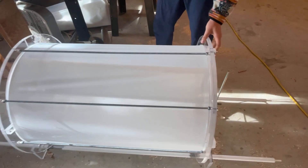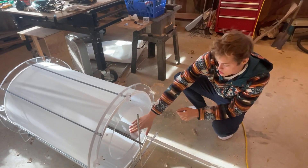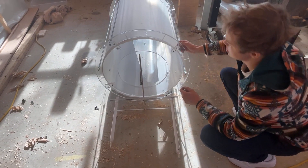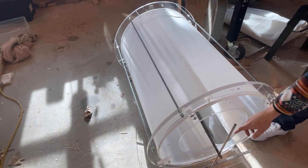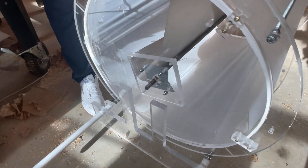We ended up just bracing it together with these braces, which should hold up pretty well. The other aspect of this project is the center trough, which is a single piece of stainless steel flashing bent in a J-shape. As it rotates it should be weighed down and pressed in to scrape the spirulina off. It doesn't rotate because it's anchored here, and on the other side it's pinned into the back so it doesn't fall out, but it can still rotate — which turned out pretty well.